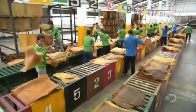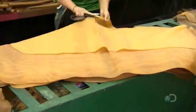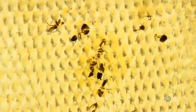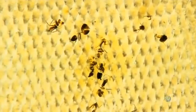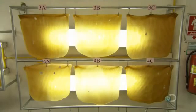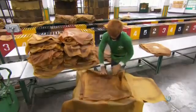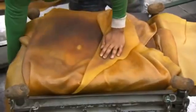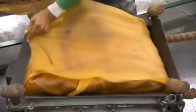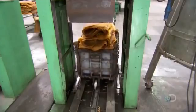After smoking, they clip out contaminants like bark or insects that have become embedded in the rubber. In many cases, they can't get it all. They grade the rubber sheets by examining them against a bright light. Sheets with fewer remaining contaminants receive a higher rating and will command a better price. They stack the sheets according to the grade, and then it's into a hydraulic baler.